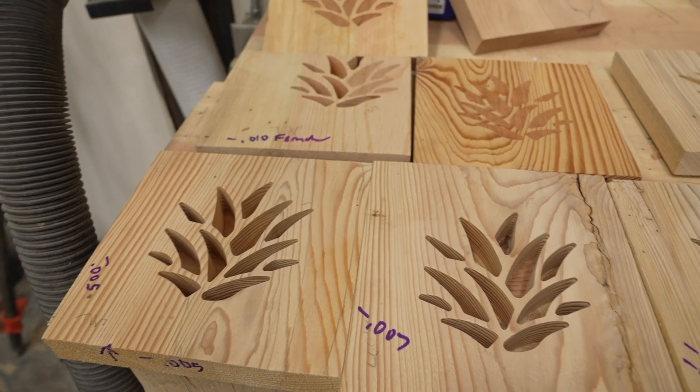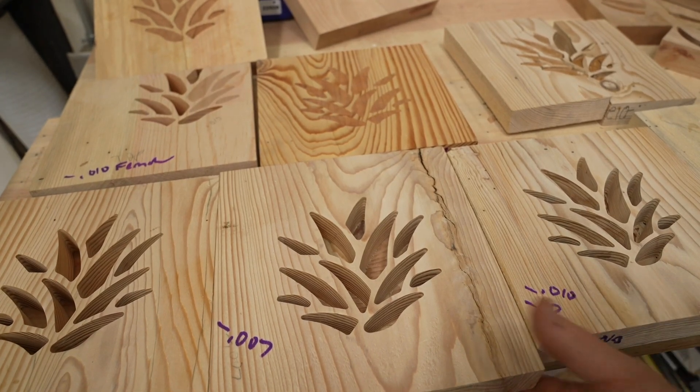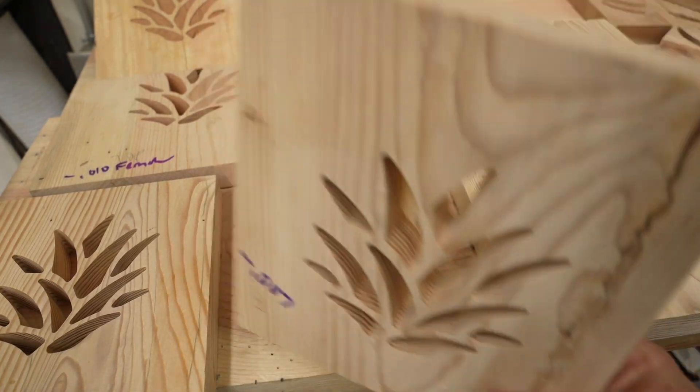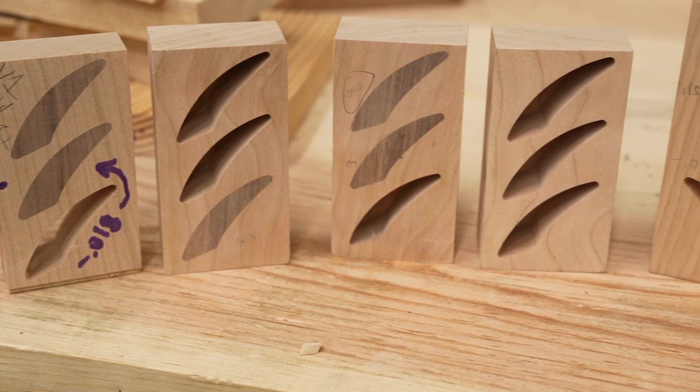Let's talk about the series of mistakes I made to get the perfect tight inlay. First, I did a series of tests using some scrap pine wood because it was cheap and I had it around. One mistake I made was I kept cutting out the entire shape. Eventually I settled on using a smaller test piece to find the perfect fit, and this minimized wasted wood.